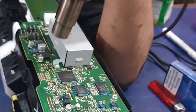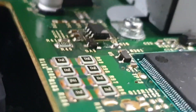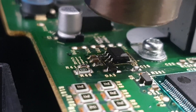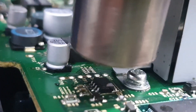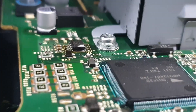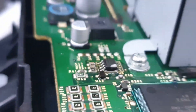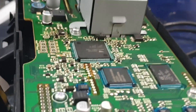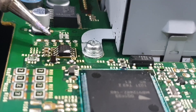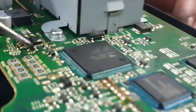We're going to use the hot air blower to secure all of the connections and pins together. Once it's heated enough, it will melt itself back together, and then you can use a soldering iron to touch up and confirm all of the connections are in place. This will remove any doubts about false or loose connections.